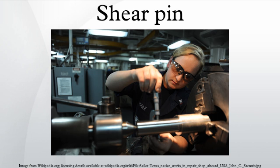If material fatigue were to weaken a shear pin, the pin could potentially be broken by a force smaller than the original threshold force, causing the mechanism to operate unintentionally, or a safety shear pin to break during normal operation of the machinery it protects. The pin itself may be as simple as a metal rod inserted into a channel drilled through two moving parts, locking them in place as long as the pin is intact. It may also be a plain metal rod inserted through a hub and axle. The diameter of the rod, alloy, and tempering of the metal are all carefully chosen to allow the pin to shear only when the predetermined threshold force or shock is reached.